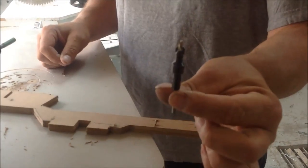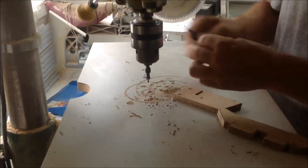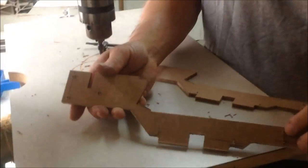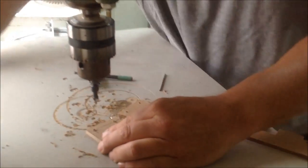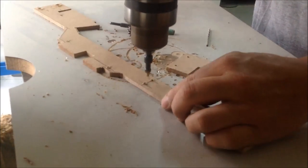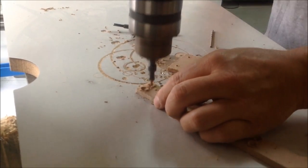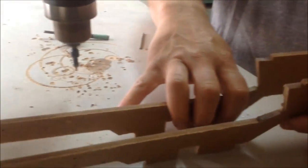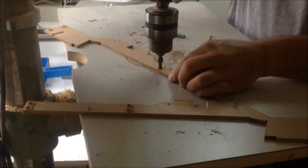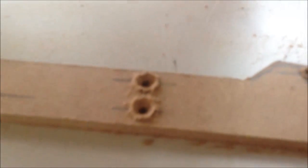So now we're going to do a countersink. This is my countersink — we're going to put it up in the drill press. I always like countersinking all of my chassis screws. So we're only going to countersink the ones for our frames. Remember there's a left and a right. So let's raise it up here. That's one side and then you've got to do the other side.